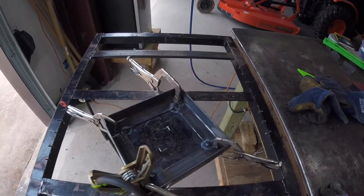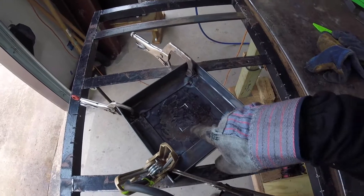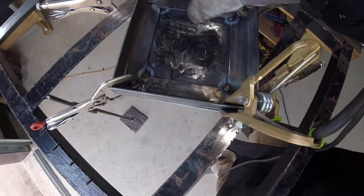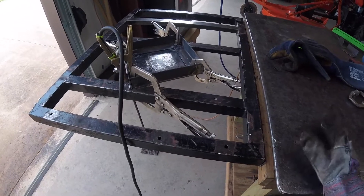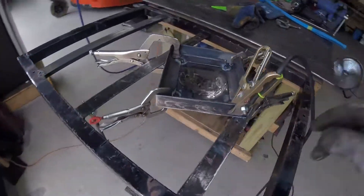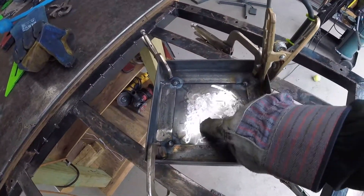This is the 8-by-8 that's going to be the top. I had to clean some of the mill scale off so I ground some of that out. I took the cutoff wheel and made my marks for my 90 degrees so I can sit the tube right in the center and weld it down. I went around the four corners and just tacked the top — 3/16, I guess it's called 10 gauge — on the top of here. I'm going to go back around and tack weld the corners. The main thing is I'm letting it cool off now with the clamps, but that's going to be my 90-degree marks.